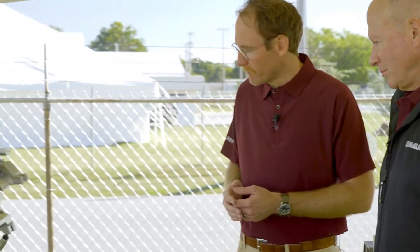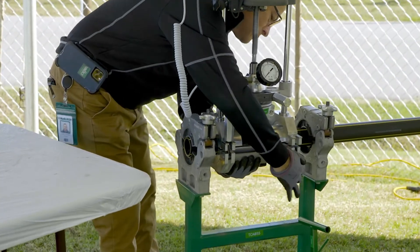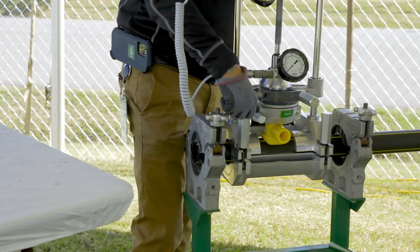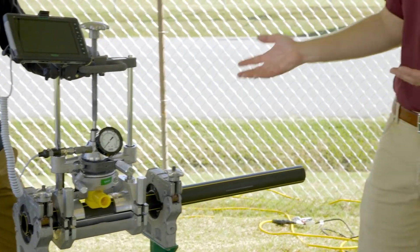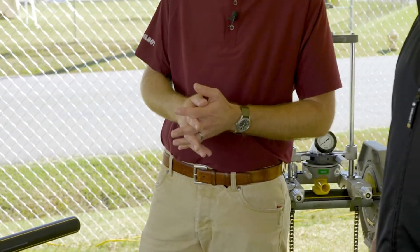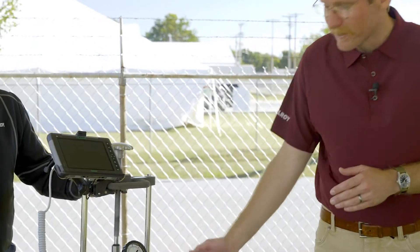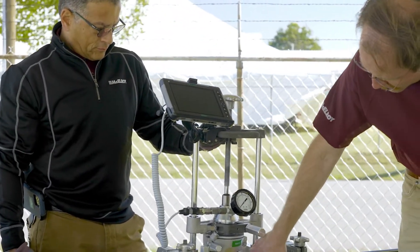In addition to that, this version we have over here is also our jaw clamp version. Juan's going to place it on the main pipe here. The jaw clamp won't accommodate as many sizes — it's not as versatile — but if you know that your main sizes are only inch and a half to four inch IPS, the jaw clamp is definitely more efficient. This is an opportunity to show you some of the innovations in this product line. We've been making Sidewinders for almost 40 years, but that doesn't mean we've stopped innovating. In our jaw clamp, we have what we're calling our re-rounding inserts — a collaboration with one of our end users who wanted to utilize the jaw clamp Sidewinder to provide even more re-rounding of their mains.